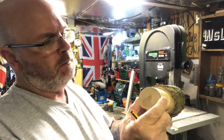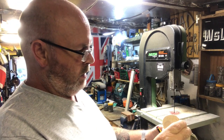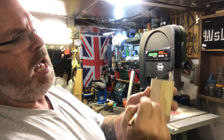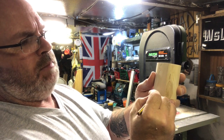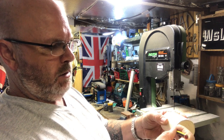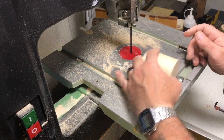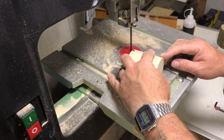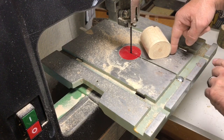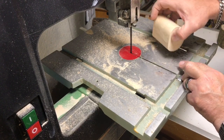This bit is the drawer — it's going to go in there. We need to chop a bit off the front and back of it. I'm just going to mark the bottom and put a little F and F on there because we're going to chop across there. I'll stick a B and a B there as well just to be sure. I'm going to cut about a 10mm slice off the back and the front. Just a note on these: the reason why I give the drawer a bit of a flat is not only for the drawer, but also on the bandsaw — because when you slide it in, if it's very round it'll try and grab it and jam it. So that gives it a bit of support.